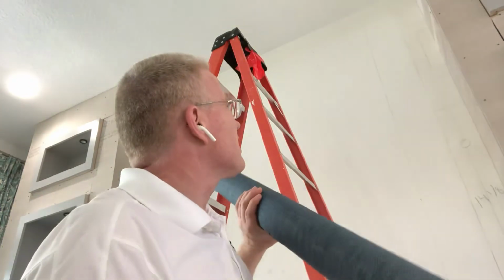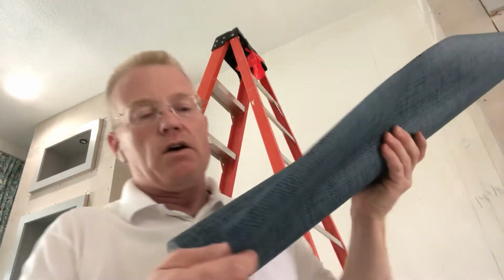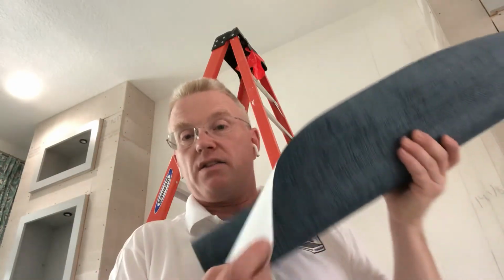Okay, so I'm ready to install. In fact, our waste is only about 6 inches on each side. So it's good. We're not wasting that much. So I'm going to go out and glue this. Now, what am I using? Well, as I suspected, this particular grasscloth has great backing. This stuff is awesome. I know from just the look of it, it requires Romans 880, heavy-duty, strippable, clear paste, because they don't want you discoloring the wallpaper with a non-clear glue.